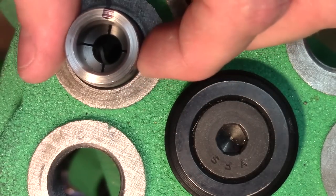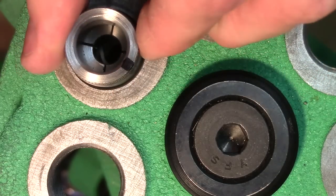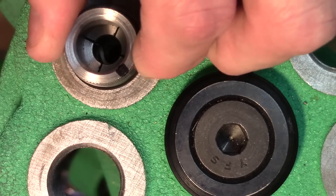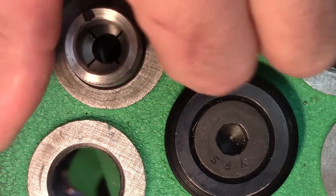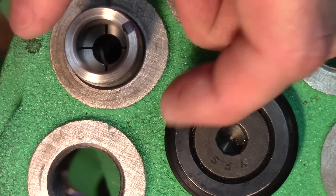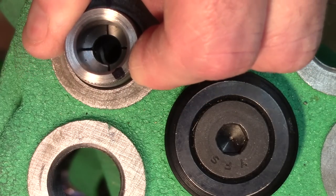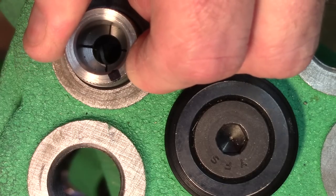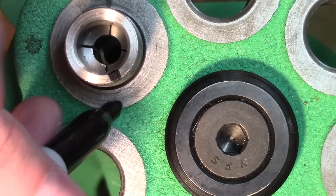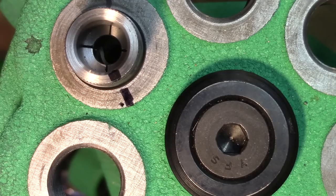All right, there's one turn back, and we're loose. So, about right there is where it's touching the shell holder, and I've taken up all the slack. I guess you might call that finger tight, which is not enough to move those. If you look at the collets, they are not squeezing together, like, if at all. So let's mark that as absolute minimum.